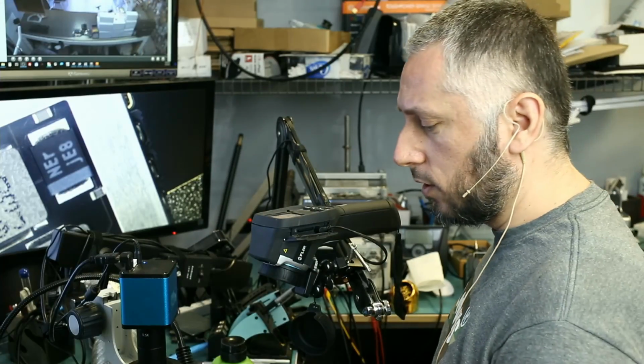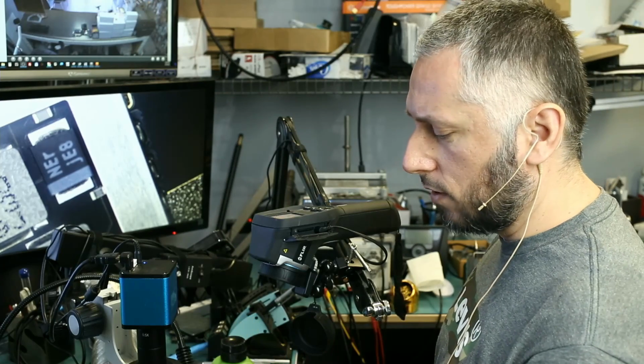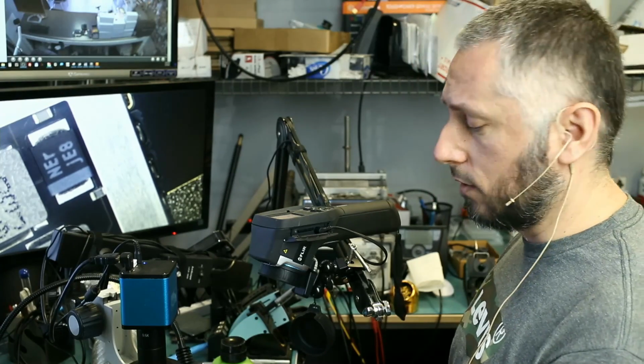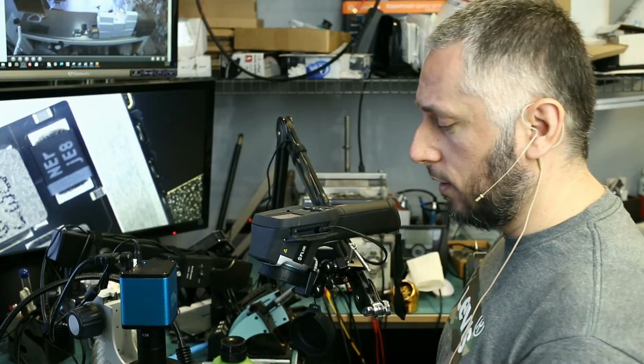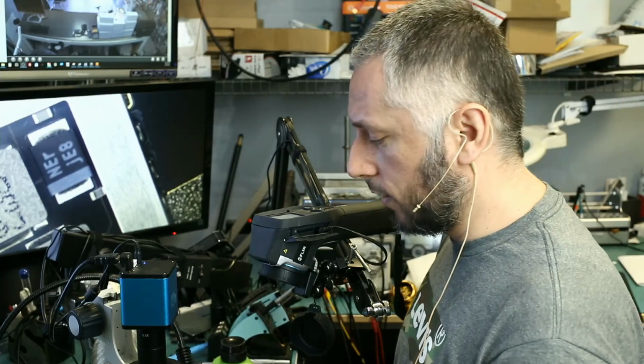If voltage was reaching the board, there should be some type of amp draw. I disconnected the battery and same result. I did a soft reset, same result. If no voltage is reaching the board, that's a charging port issue. We'll continue this in the next video and hopefully we can come to a solution.